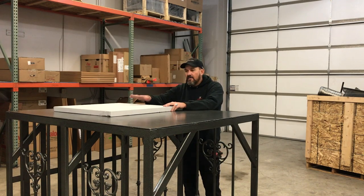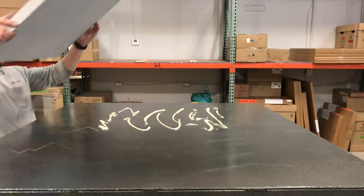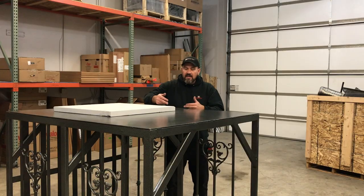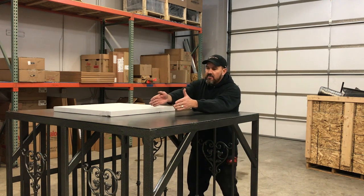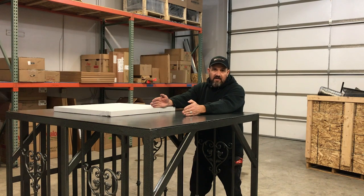Step one: placing the 27 by 27 inch insulating board. Now if your minimums are the 42, you're going to have seven and a half inches on each side, and I would equal that on the back. You want to have more room in the front, and remember you've got 11 more inches to the finished front for your pizza oven.